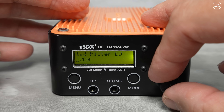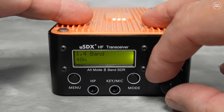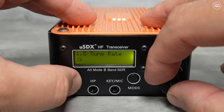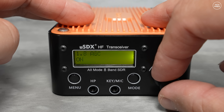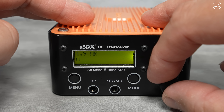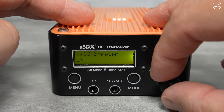Filter bandwidth options include 3 kHz, 2.4 kHz, 1.8 kHz, 500 Hz, 200 Hz, 100 Hz, and 50 Hz. In my opinion 3 kHz or 2.4 kHz sounds best. Item 1.4 changes the band; 1.5 is the tune rate, also adjustable from the main screen by tapping the encoder. 1.6 selects VFO A or VFO B; 1.7 is RIT; 1.8 is AGC on or off — I left mine on throughout testing. 1.9 is noise reduction amount; 1.10 is attenuation, useful for strong signals; 1.11 is attenuation 2; and 1.12 switches the signal strength indicator between dB and S-points.